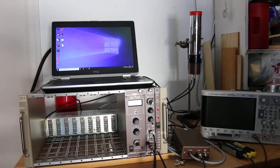So here's sort of the equipment that we'll use. Of course, the primary importance is the detector, and you can see that right here. This is a sodium iodide thallium activated detector, and sodium iodide is, of course, a crystal, and that crystal needs to be sort of protected, so it's inside this aluminum case. And it's okay for it to be inside of aluminum case because gamma rays, as you know, pass readily through aluminum, particularly thin aluminum. This is probably about 2 millimeters thick or so, protecting the crystal so the gamma rays can pass right through the aluminum, typically through the front here for detection.